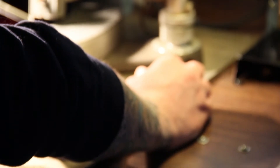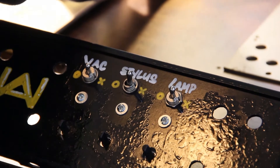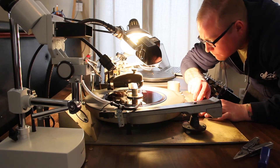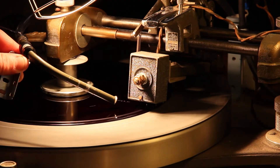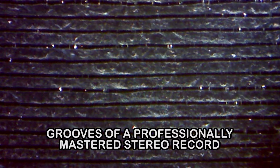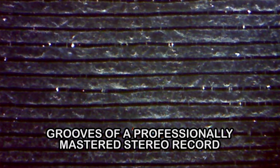Once you get the sound to the cutting head, that's where it becomes a little bit tricky, a little bit subjective. It takes a little bit of an artist's touch. You have to work with your depth of your stylus setting, how much signal you're actually sending to it. And this creates a situation where you can do your best to try to replicate it each time and maybe come pretty close. But there's all kinds of variables that you can't control for that are going to lead to unique pops and cracks, maybe a little bit of hiss in each separate cut that you make.